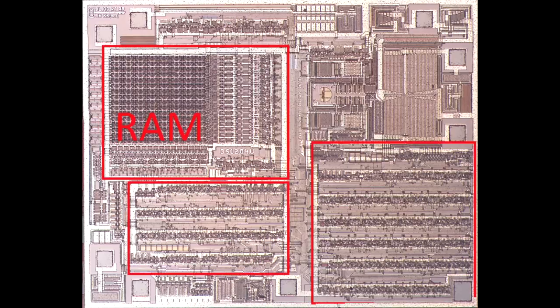The other two areas below are logic gates and have a classic pattern. You always lay down a voltage rail and a ground rail, then between them you lay down your gates — that's why you see this very regular pattern. There are only so many gate types: AND, OR, NOR, NAND, XOR, Buffer, and Invert. So the patterns are, of course, very repetitive.